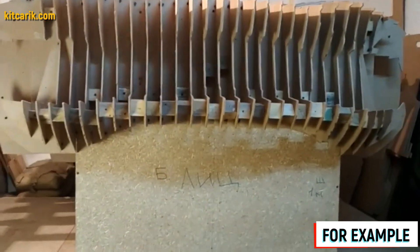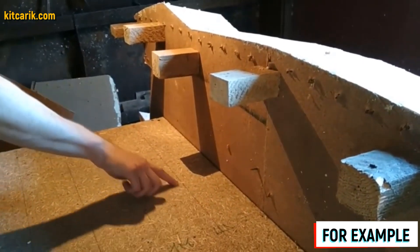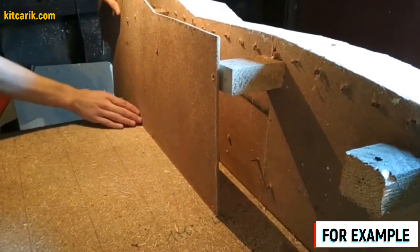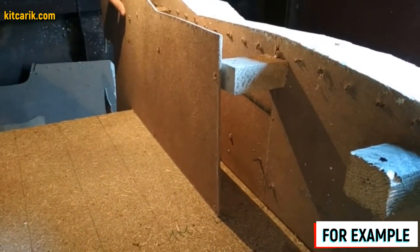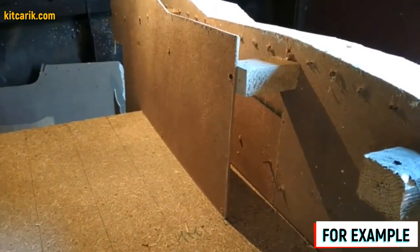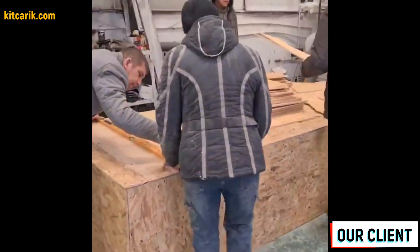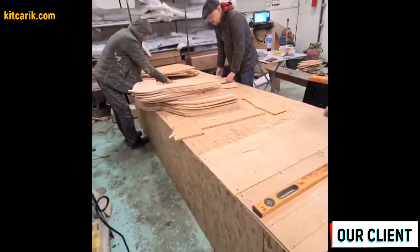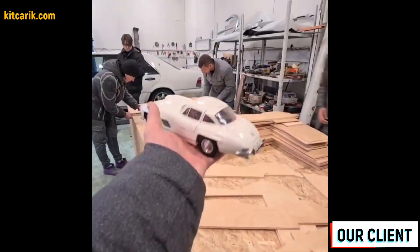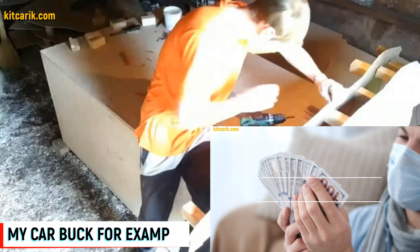The fiberboard sections are numbered so we don't get confused during assembly. We put the mirror halves of each section together to form a whole section and fasten them. We continue strengthening subsequent sections with each other using cubes of nine and a half centimeters, in order, one line after another. Since I don't have video of assembling the Mercedes 300 SL Gullwing car buck specifically, I'll show an example of assembling another car — the process is the same for all cars.